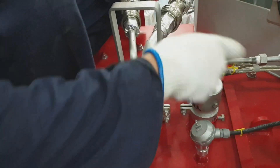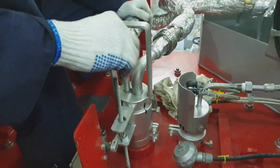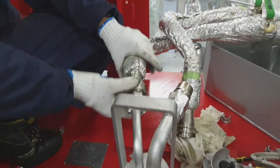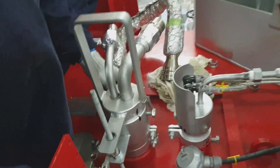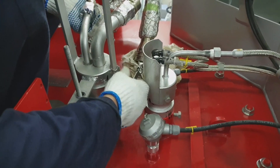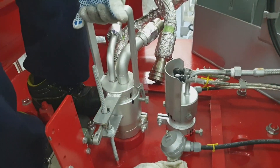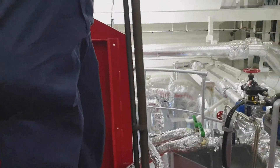Now let's proceed. As you can see, first we have to carry out the lockout and tagout of the machinery, then we have to secure from the local. After securing, we can proceed to the disassembling of all parts. Right at this moment I'm detaching the quick release connection of the main burner — the steam and the fuel oil — and unlocking the locking bolt of the main burner so that we can draw out the burner assembly. Just draw out slowly the burner assembly.